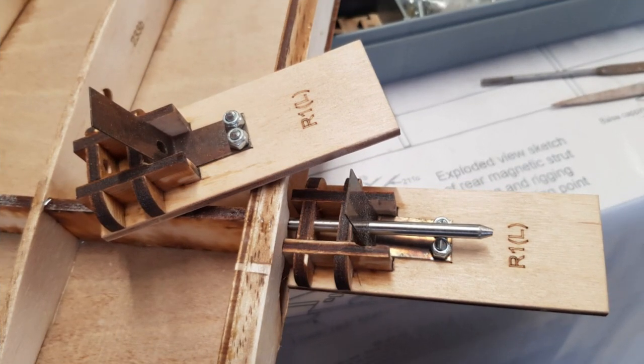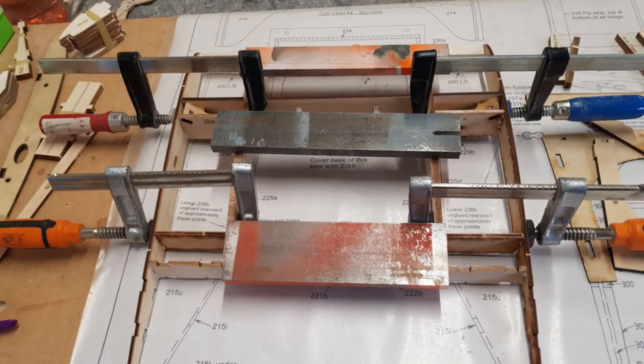Day 6. I started the morning with filing together wing fastening lock number 2. There is a lot of work involved in sanding down every slot and pin until everything fits together and can be glued. Just as an example, the steel locking clip is 13mm wide, but the space where it must sit is 12mm wide. The holes through which the piano wire must pass are exactly 4mm, but the piano wire pins are 8G, which is 4.1mm. Then I assembled and glued the first part of the lower wing center section, a sort of 3D jigsaw puzzle.